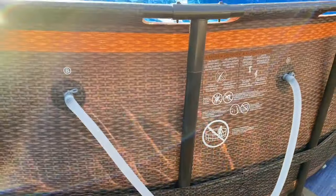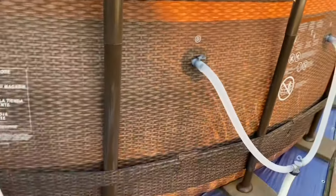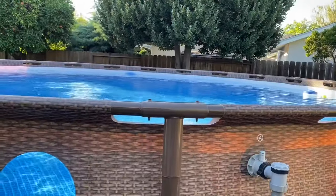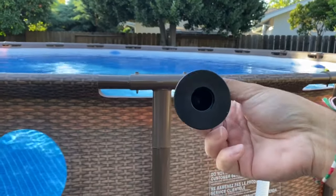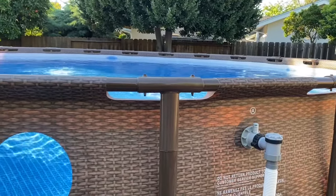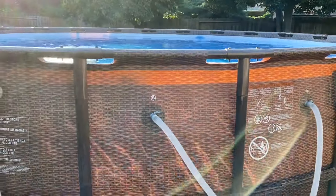We have two B inlets. I don't have a plunger valve on my inlets, but I've ordered one. We have one outlet which is the A port on the pool. I've upgraded my pool filter to an Intex 16-inch sand filter — I highly recommend that you all do that. These here are actually stoppers; they go in towards the B, towards the wall, towards the inlet, and they stop water from rushing into the actual lines while you're maintaining your filter or pump. I won't be needing those today.